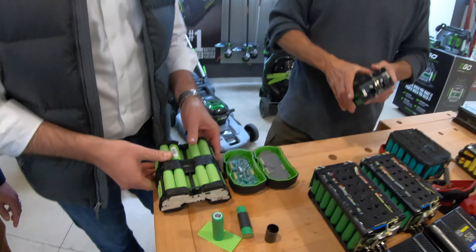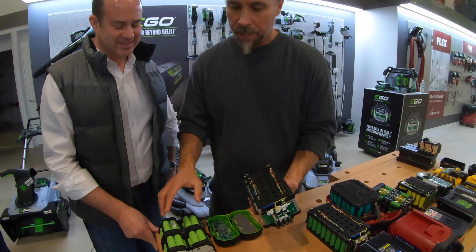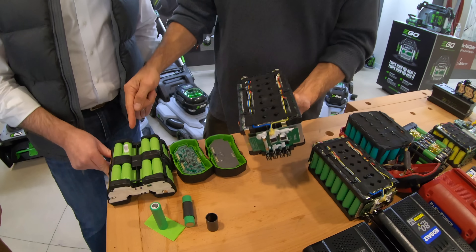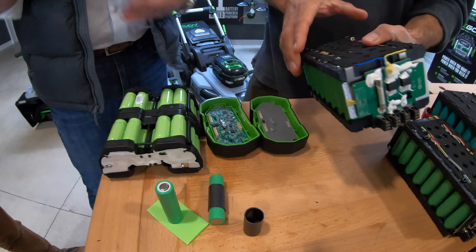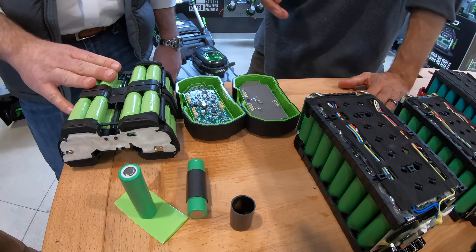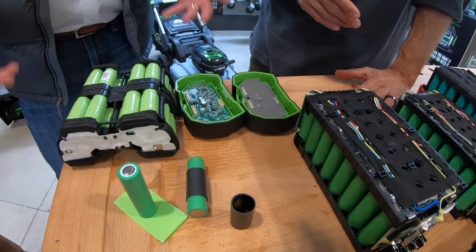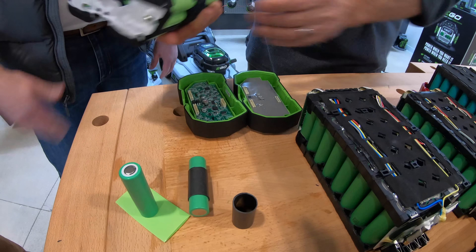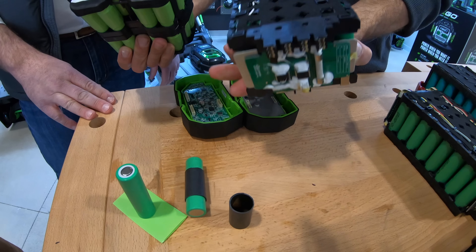You just jumped over an important point — you have no center battery. In some tools there might be larger battery packs with 3P technology, three parallel rows, and you might have some interior cells. But you're going to have much more surface area with the arc design, especially on 1P, definitely on 2P. So a lot of great advantages with the overall arc design.